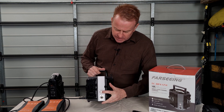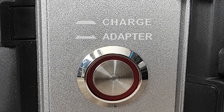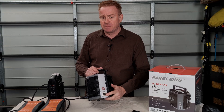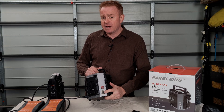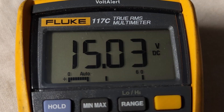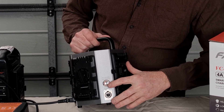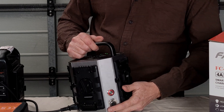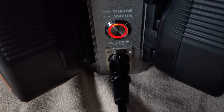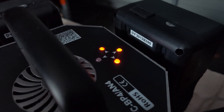You've got a choice of two modes of operation: charger mode for charging your batteries, and adapter mode which uses this outlet here — so you can use this as a camera adapter. One thing to note is that outlet is 15 volts, not 12 volts, and it is rated at 4.5 amps. When you put it into adapter mode the switch lights up red to indicate adapter mode, and one of the green lights on top will turn off. In adapter mode you can have power coming out of the DC outlet and still charge three batteries simultaneously.